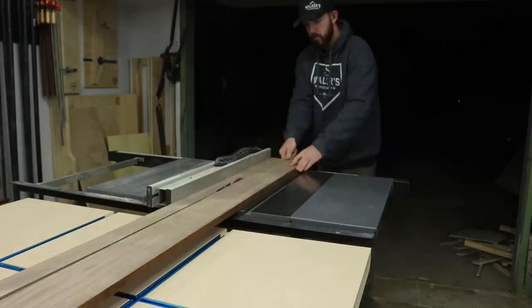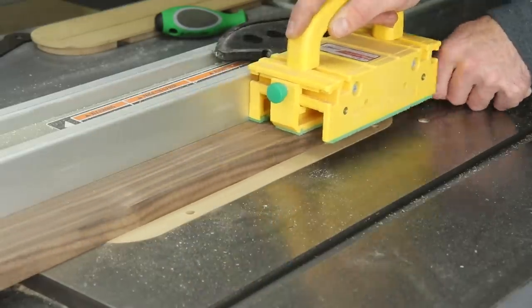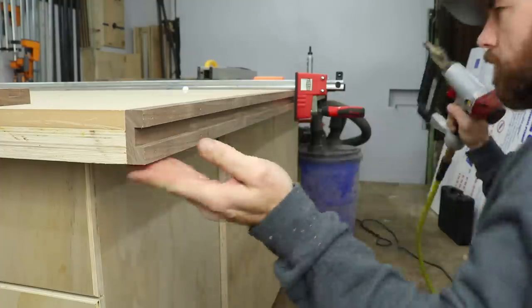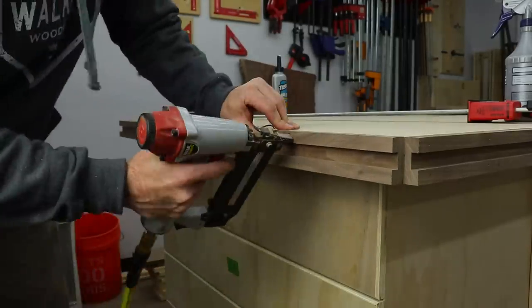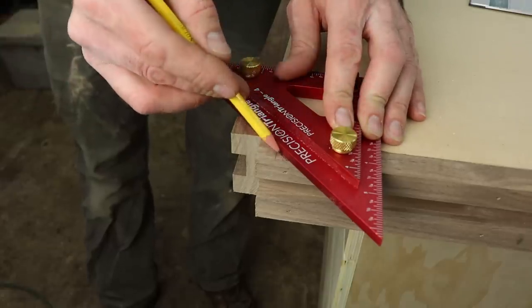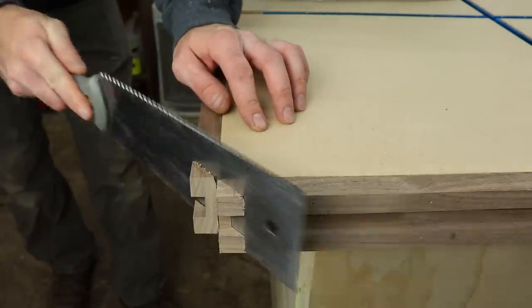I figured I'm going to have this workbench for a long time so I wanted to make it the way I wanted it and have it look cool in my shop. I decided to use walnut for the trim, the door handles, and all the drawer pulls. There are a few assembly tables like this one but I haven't seen any that incorporate T-track in the sides so you can clamp things in vertically. I attached the trim with brad nails and glue and only added the track to one end and one edge. Once everything was attached I cut the corners off so there's no sharp corner to bump into and it also allows the clamps for the T-track to slide in very easily. The track saw didn't go all the way through so I had to finish it off by hand.